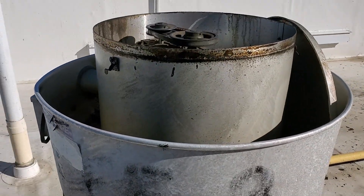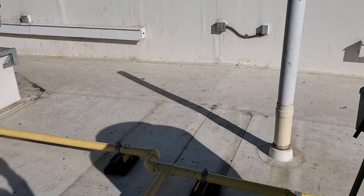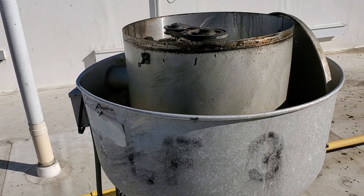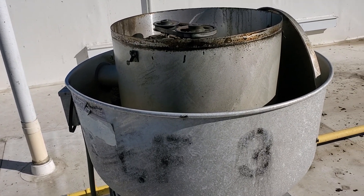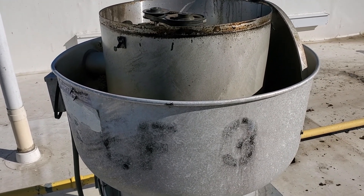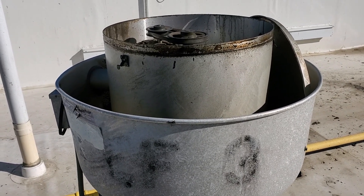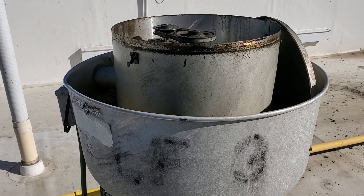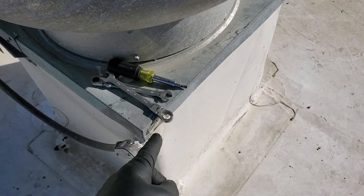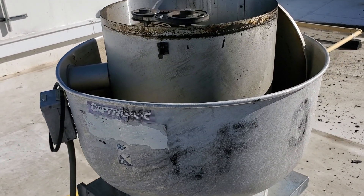This place has several belts that are worn out — they're loose and just worn, so I'm going to replace them. By the time I got to these belts it's about 10:45 and they're already cooking downstairs, so you have to pay attention. Some kitchens you can do this on where you can shut down a hood, some you can't. This kitchen will be okay — it all has to do with the amount of heat coming out. Certain restaurants have charbroilers and the hoods are really close to the cooking equipment, so the heat's just going to be insane. This one's not one of those — I can do this, but I have to be quick. So I have everything ready — maybe the belt will go right on, maybe it won't. I've got my wrenches ready so I'm not looking for stuff. I'm prepared for the worst.